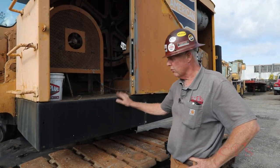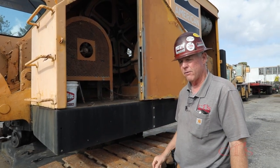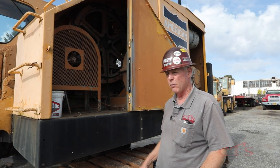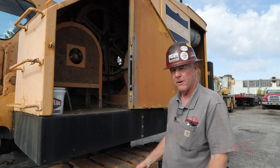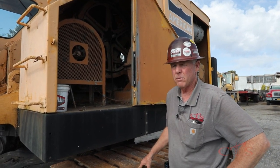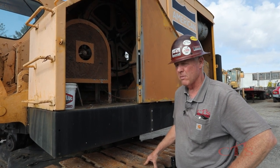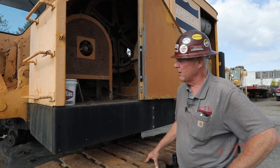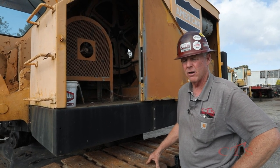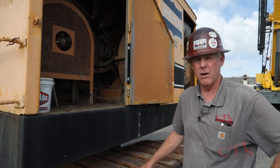This particular crane is a true friction crane. When we talk about free fall, we have to make sure that when we release our foot off of our hoist line, we have our foot on our brake - otherwise, the load will come down. When we talk about hoisting personnel, we can't use any type of crane like this because it is a free fall crane. OSHA 1926-1400 specifically talks about when you're allowed to have free fall and when you're not. This is old technology with no computers, but there's still many of them out there. Marine contractors love these cranes on barges; they're excellent for pile driving work.